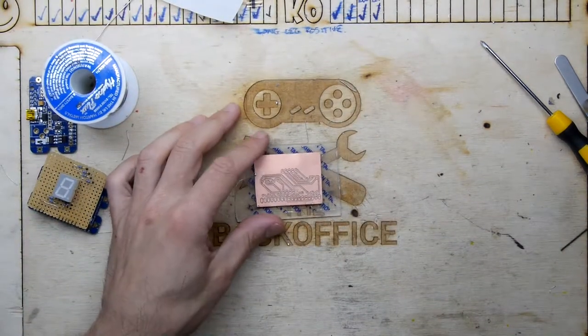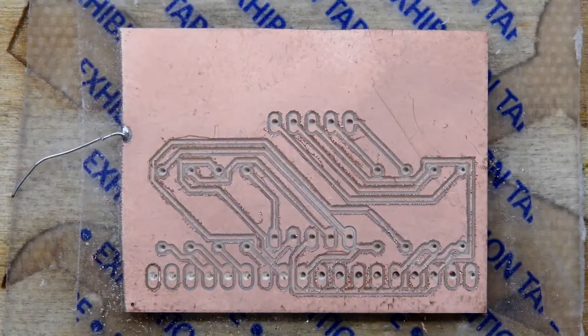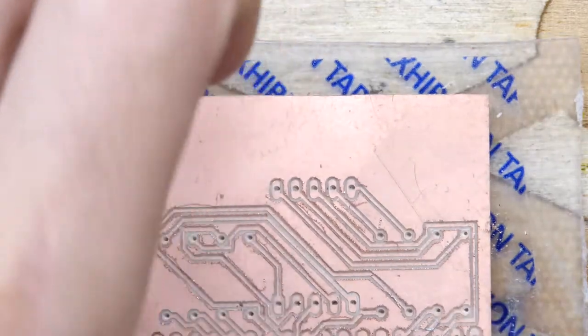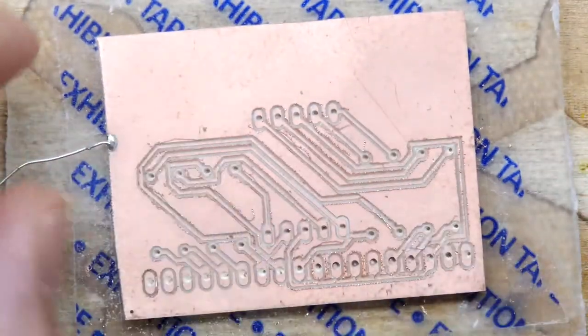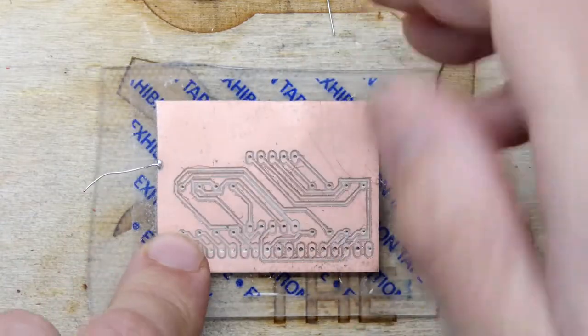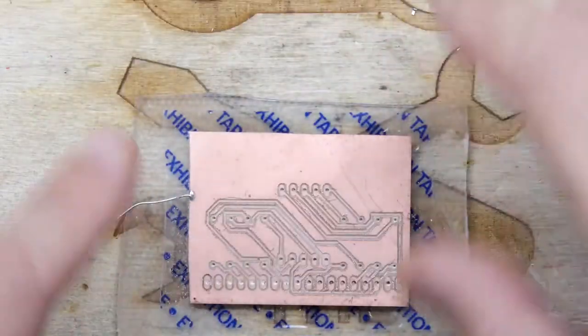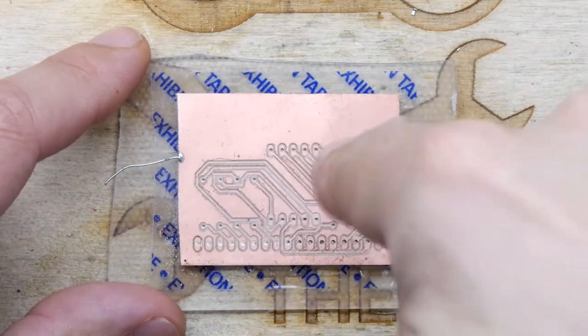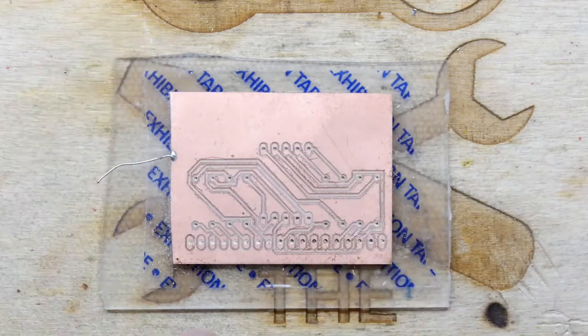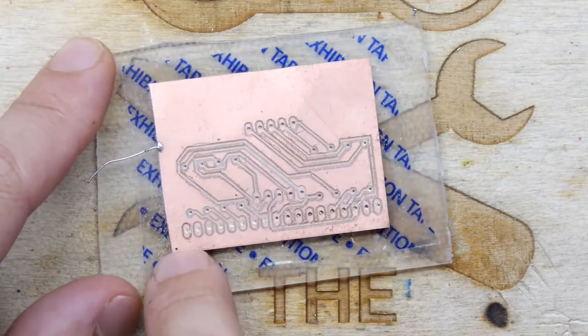So we're going to zoom in on that, and I'm going to get myself a slight abrasive. I say slight abrasive, this is crazy abrasive, look at that. It's like a sponge, just because I think we're going to need that. So you can see here, that's the probe that I soldered on so that we could actually make the board effectively live, as far as the pull-up into the Arduino type thing on the board, the ATmega, so that when the spindle touched that, it dragged it to ground and it said depth reached. And you can see here this little 0-0 calibration blip right there.